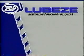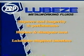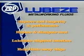Lubeze metalworking fluids from ZEP result from much exhaustive research. They improve tool longevity and performance, reduce and dissipate heat, lubricate the interface between chip and tool, and help flush away chips. Now, watch what happens when a small amount of fluid is introduced. The shear angle rises, and the chip immediately becomes thinner. The build-up edge that causes poor finish is gone.